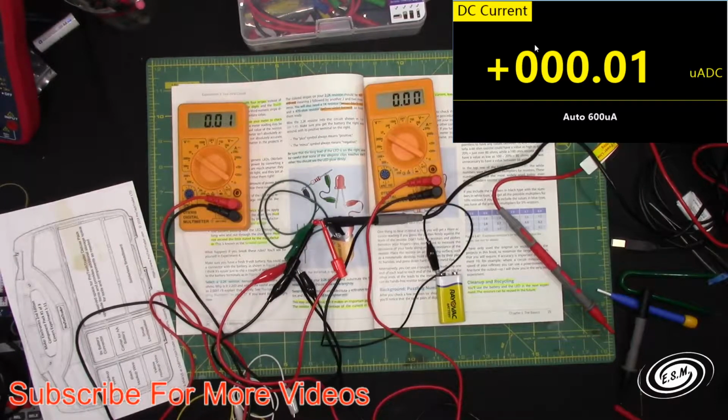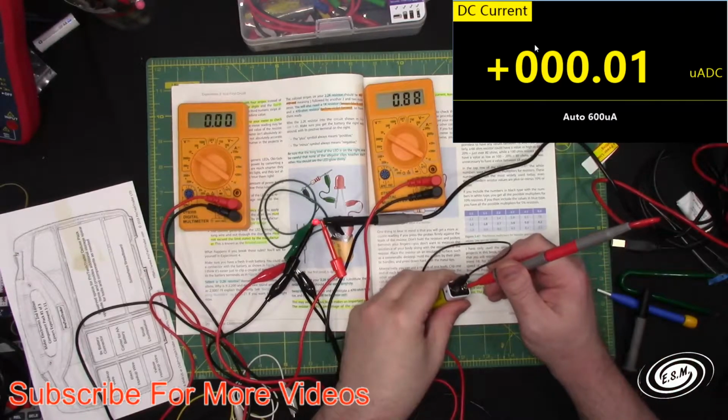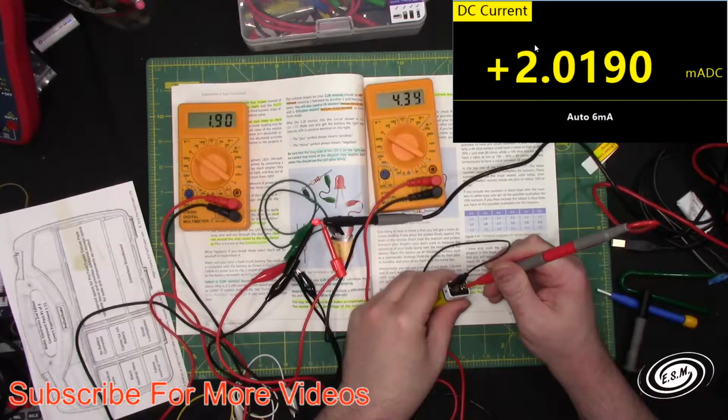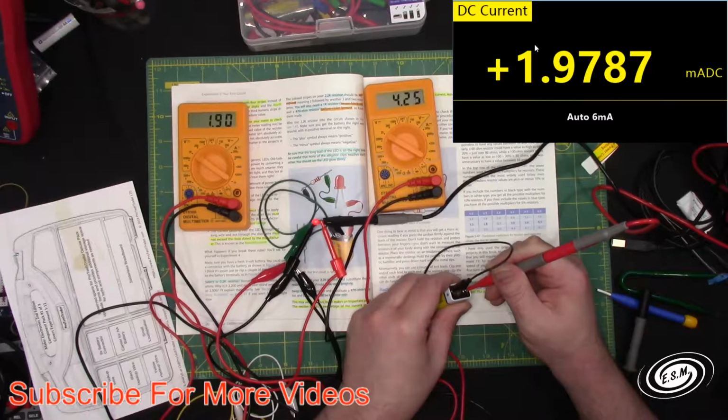Now, I would say that the voltage drop of the diode is going to be in the 2 volt range, and the rest is going to be dropped across that resistor. So let's find out. So we're still drawing 2 milliamps. The diode is dropping 1.9 volts, and the resistor is dropping 4.28 volts. So if we add, so say 5, 6. So we're really only getting 6.5 volts coming from all this. That means the wires have resistance and they're dropping some voltage.